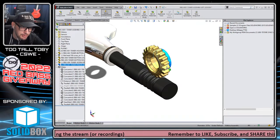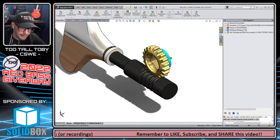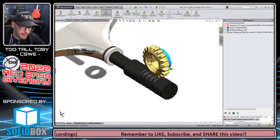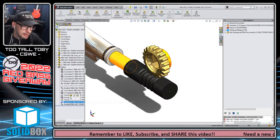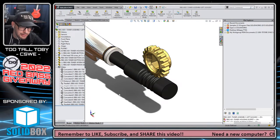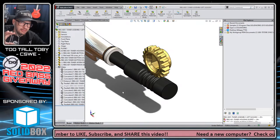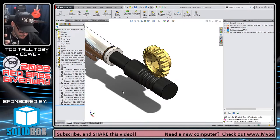If I take this gear and I move it around one time, then we'll see the other components going around 20 times. So it works in both directions. The pro tip when it comes to the gear mate is that you can suppress the gear mate, move your components into position, and then unsuppress the gear mate, and the components won't jump back to their original position.